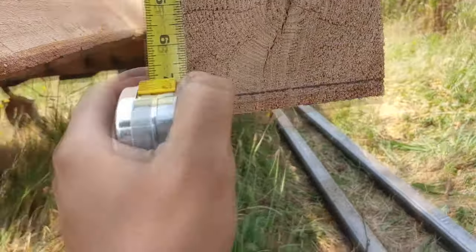I don't want to make it too wide, because if I make it really, really wide, the end plates stick out. If the tree is pretty skinny, I don't have a lot of meat, they stick out, and then I'm fighting to get around them with the edge of the mill. So I'm going to make another set 3 or 4 inches taller and maybe an inch wider on each side, just so I can get that height to get over those knots and that butt swell in the cedar.